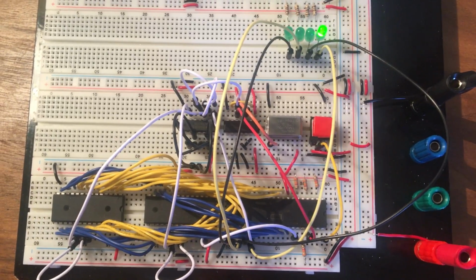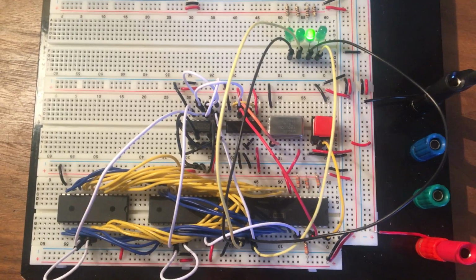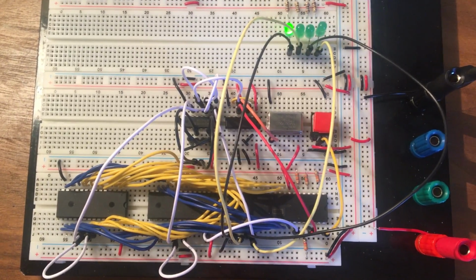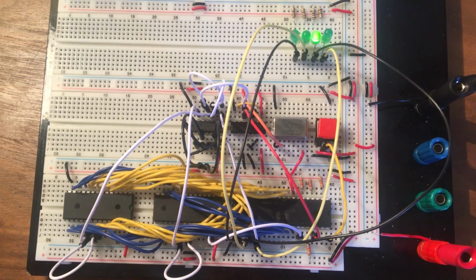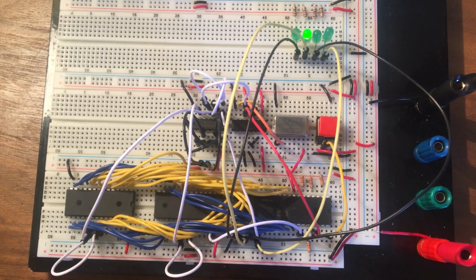So it copies a little delay loop into various places, and then it runs that delay loop at different points and just jumps from one to another, with the result that it's doing a little busy loop at different points in memory, so that once again we can use LEDs attached to the address lines to see where about it's executing and just get some basic output.